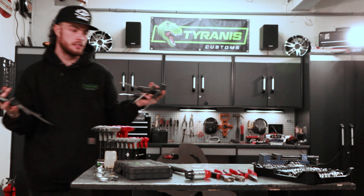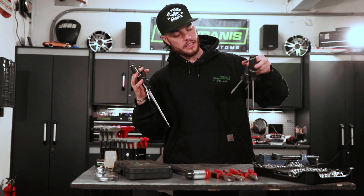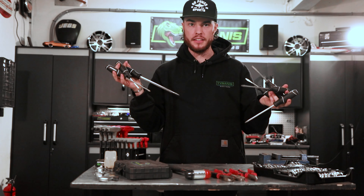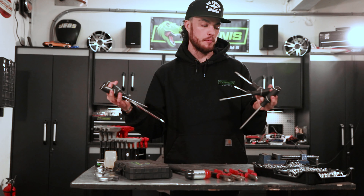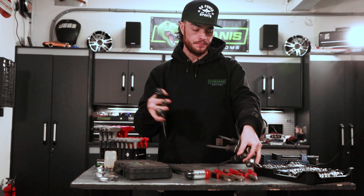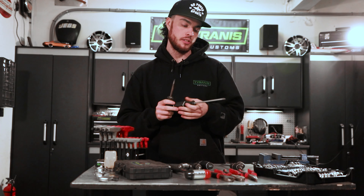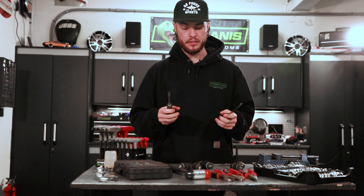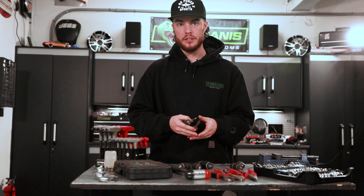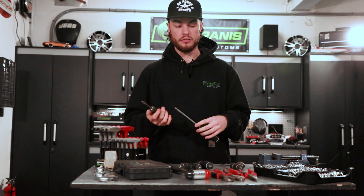The last hand tool I can think of would be a nice set of assorted screwdrivers. It's nice to have all different sizes and lengths — you can usually find these sets real cheap at Home Depot, Harbor Freight, Amazon, anywhere like that. If nothing else, get yourself a Phillips head — P2 is usually the right size for most things — and a nice quarter-inch flat head. I like having a bunch of options so I'm not stripping out screws using the wrong size.